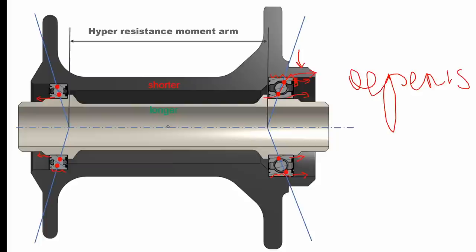If you're going to do it the way they've done it, you need to restrain the outer races with circlips all around. If you look in a machinery build guide or engineering reference guide, they'll tell you to restrain it like this. If you're preloading the inners that way, you need to restrain the outers so that no matter how hot the housing gets, they can't wander and can't start to walk — because then you'll lose all preload.